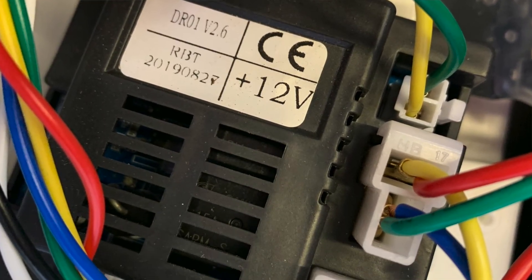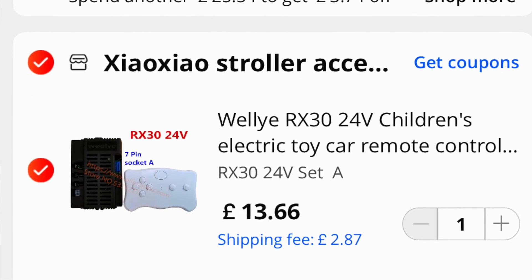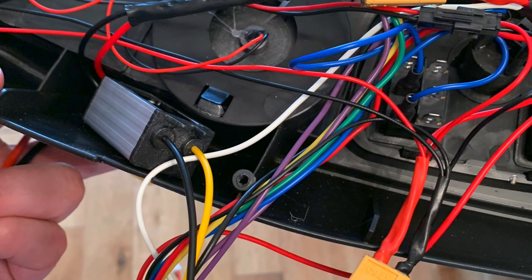It was working but it was really slow — ridiculously slow. So I thought surely it can't be that hard to upgrade it a little bit. I went online, found a few tutorials, saw what other people had done. There was a lot of work done in America on Power Wheels — that seemed to be a big scene. This is not Power Wheels, it's some Chinese equivalent sold here in the UK. It was a 12-volt system with a motorcycle-sized 7 amp-hour battery and some relatively slow motors. So the first thing was to upgrade the voltage — I got a new charge controller and went from 12 volts to 24 volts. That caused some problems because there are lights, a radio system, and a horn — a few bits of electronics — so I used a simple buck converter to drop the voltage down to 5 volts.